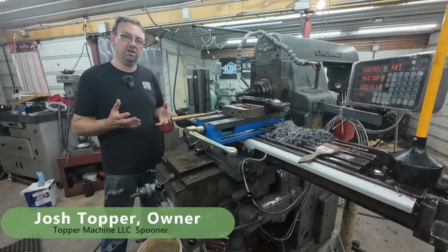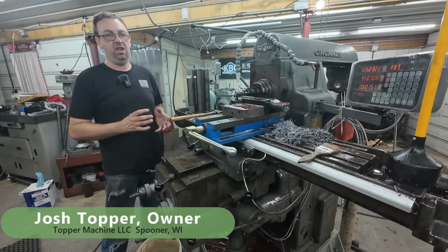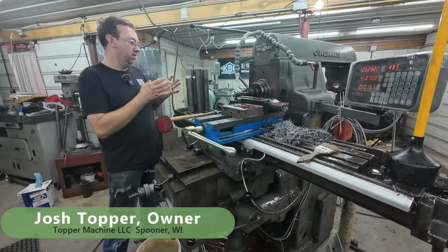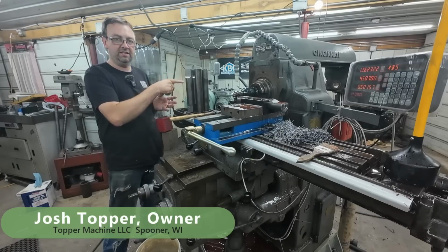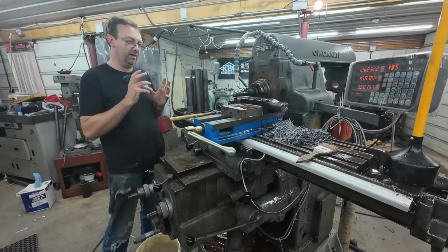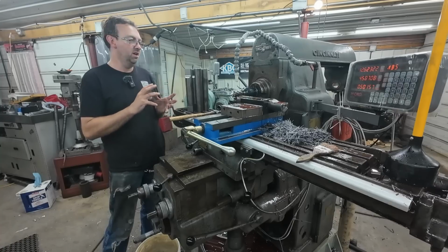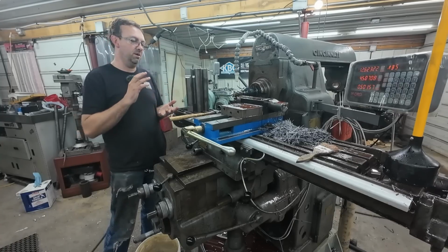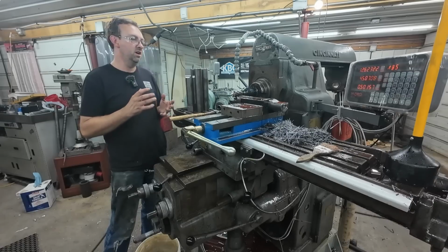I'm Josh Topper, and if you saw Saturday's video, you probably had a lot of questions about the shafts for the dragline crane that we're making, milling these flats in, and I'm sure there's a ton of questions. I haven't released the video yet, but I played with my feeds and speeds. When I calculated all this out, it was telling me 250 RPM, running 6 1/4 inches a minute.